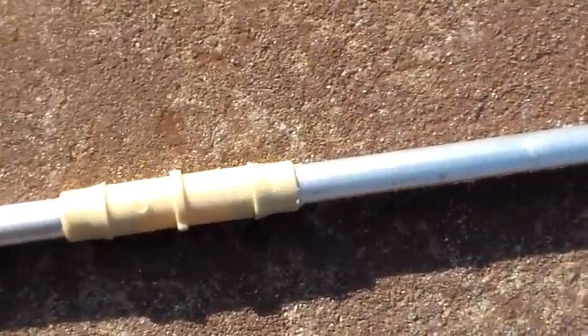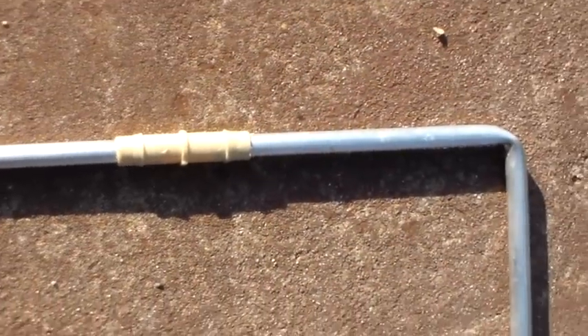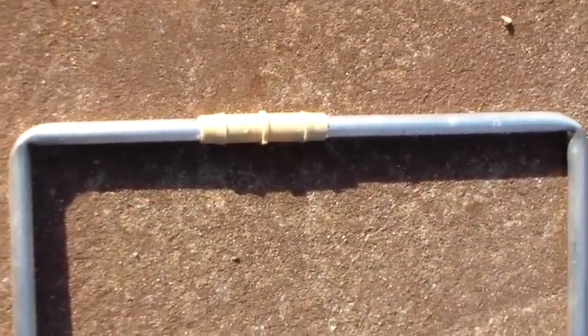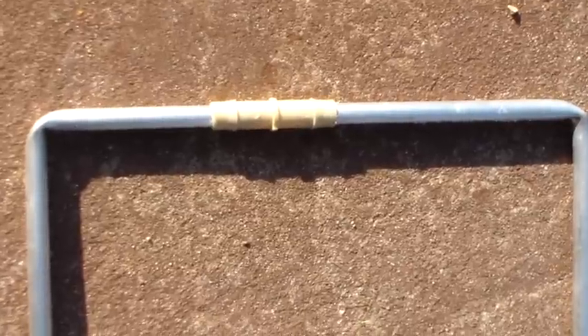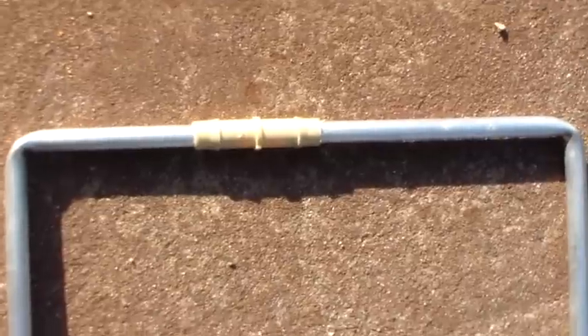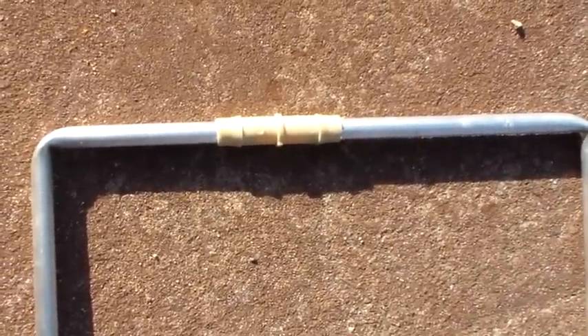There's a better look at the joint. At the top of the antenna — I'll show you the bigger picture. Now I didn't use the black plastic joints. You can probably see that beige joint in there, that beige retic joint. Remember the driven element is shorter than the reflector, so that's why the retic joint is closer to the driven element.